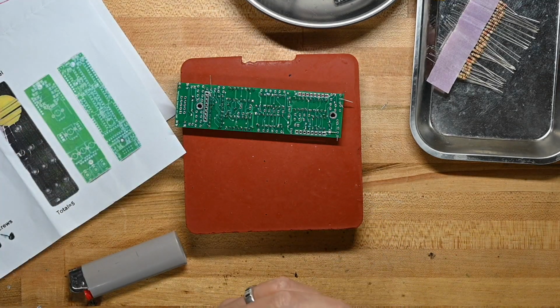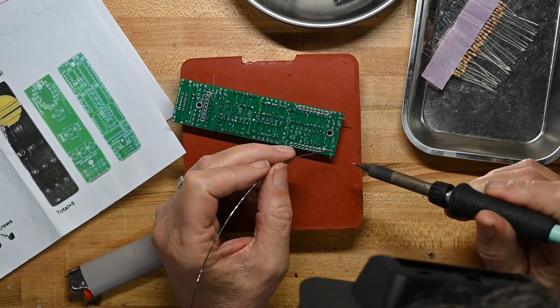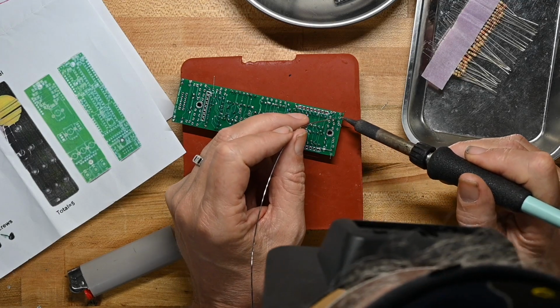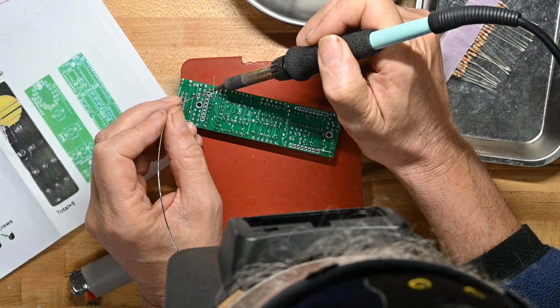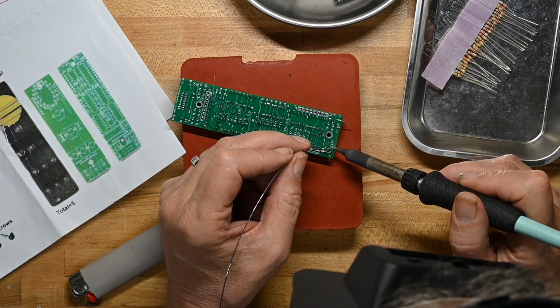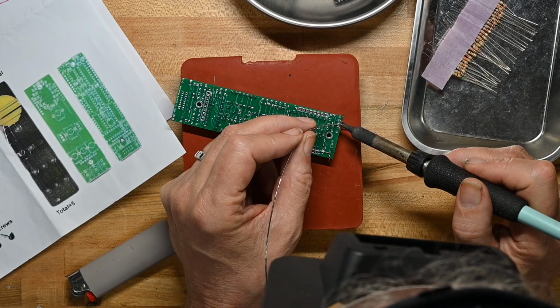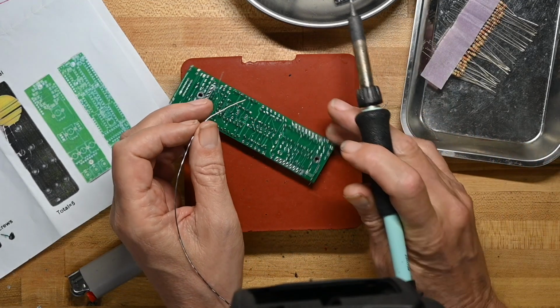And as I often say when I do transistors, a long time ago, somebody said, do the middle leg on the transistor first, and you're less likely to bridge when you're doing the other two legs. I don't know whether that's true or not, but I've done it ever since, because I see no reason not to, and I haven't had a problem, so maybe it is good.